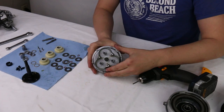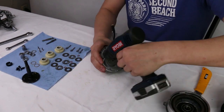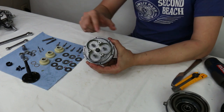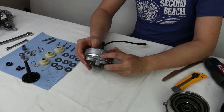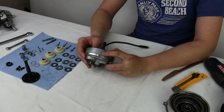With the planet gears removed, we will now remove the rotor using our number three Allen. We've removed the planet gears and the bolts holding the two housings together. Before disassembling, it's very wise to make a note of the index mark on the housings — when reassembling, that mark needs to line up.